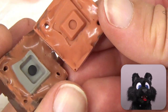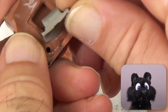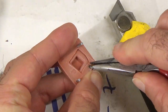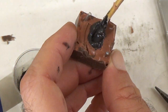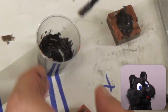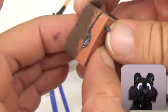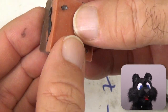After carefully prying the halves apart, I have the perfect impression of the button. Sweet! I cut in a slight groove so the poured material has somewhere to go when I close up the mold for the new button. And here we go! I used the same silicone for the button, I just added a bit of pigment so it's not pink. Not my color. Sorry. Oh, and I did make 2 molds, so I can have a pair of matching buttons, since the coloring process is a bit random.